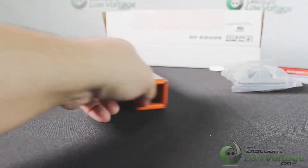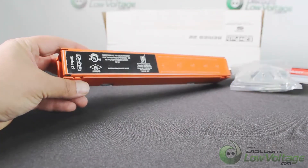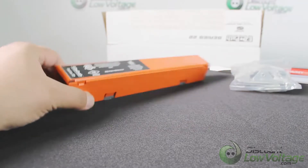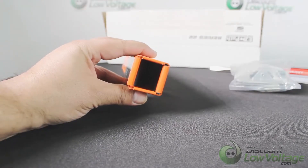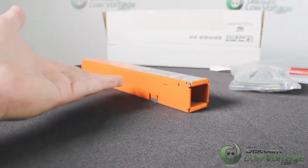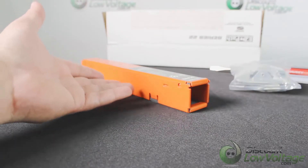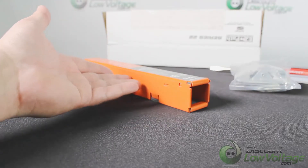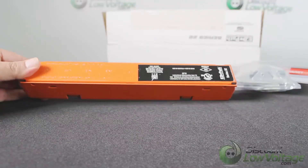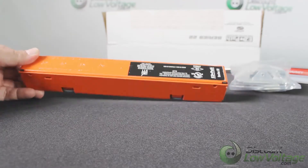This particular product is a fire-rated pathway device, and it's designed to allow cables to penetrate fire-rated walls without the need for fire stopping. The device features a built-in fire sealing system that automatically adjusts to the amount of cables installed, which is pretty cool. Once installed on a fire barrier, cables can be easily added or removed at any time without the need to remove or reinstall fire stopping materials.